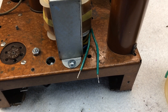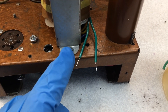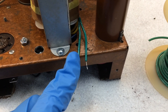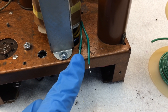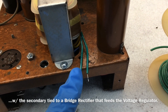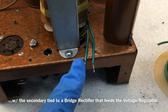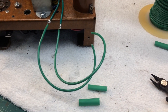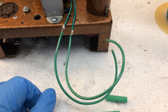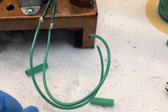You can see my leads here are just a little short on the transformer — I'll have to extend those just a bit, slide some heat shrink on, so I'll be doing that next. I've got everything soldered up. I elected to use the coil method just in case they ever need to get in here quickly, heat these up, and pull them loose in the future. Just to simplify things, and a little heat shrink here that I'll apply.